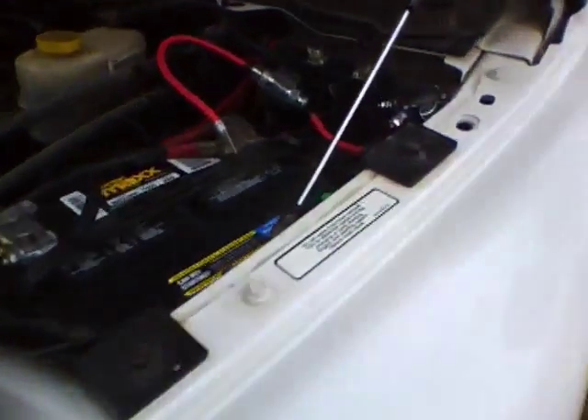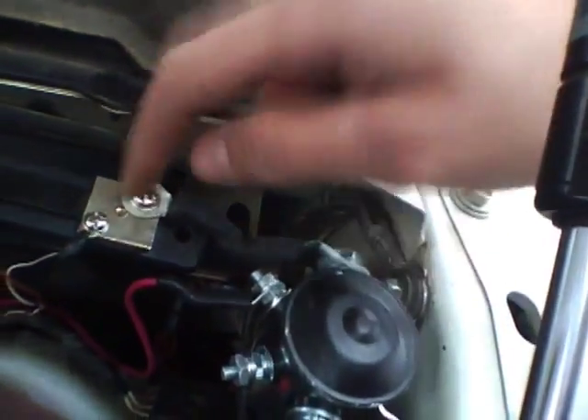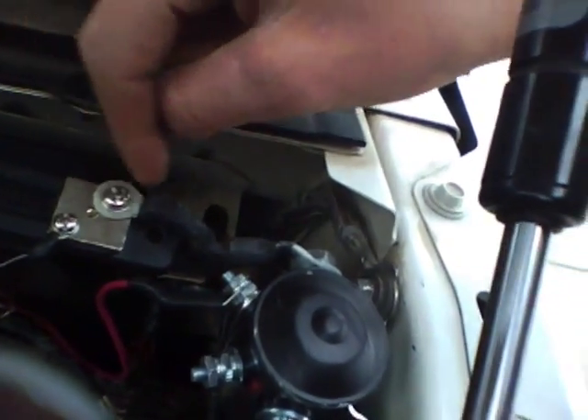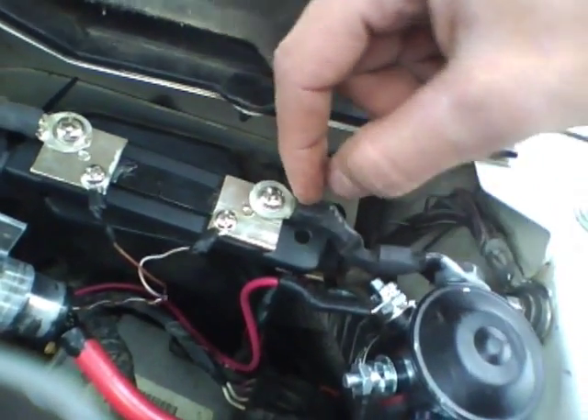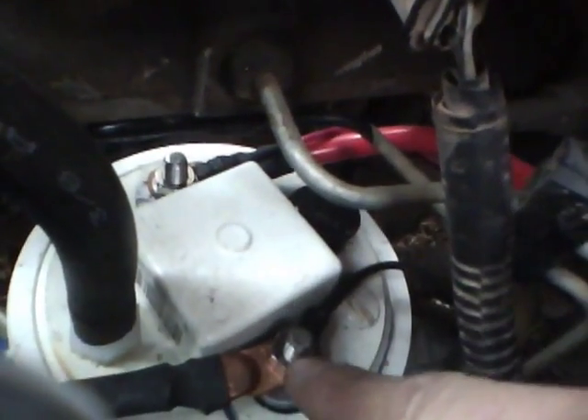For the electrical part, I had the wire ran in right here — right here, right here — and that is the relay. Here's my positive, got the 30 amp inline fuse going to this side, hit the relay, goes into the shunt here. This is what my amp meter is hooked up to — it's a 50 amp shunt. Got everything soldered and heat shrink wrapped. It goes through here and measures that, then goes down to the generator. Have the positive on the far side there, positive and negative for the ground.